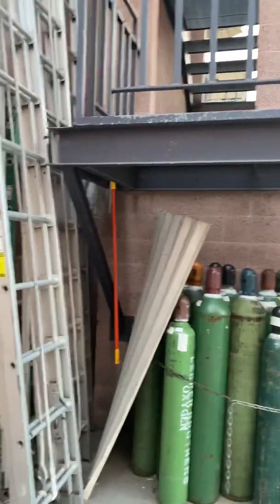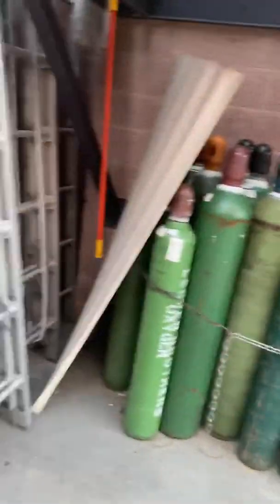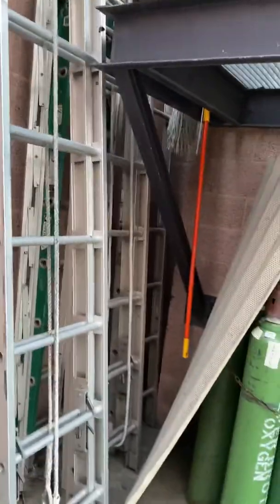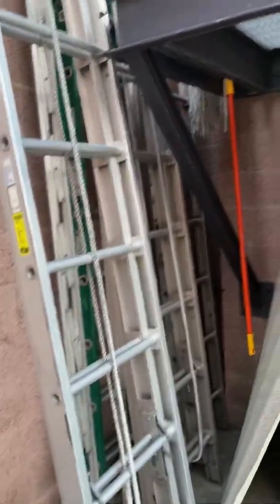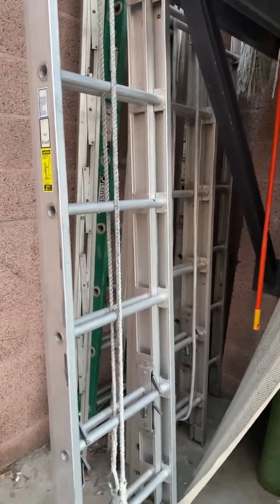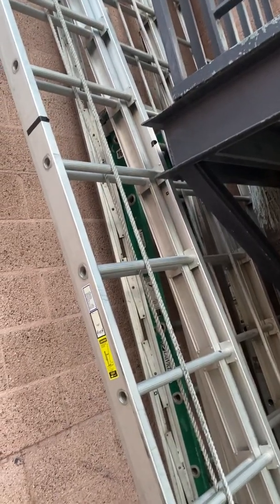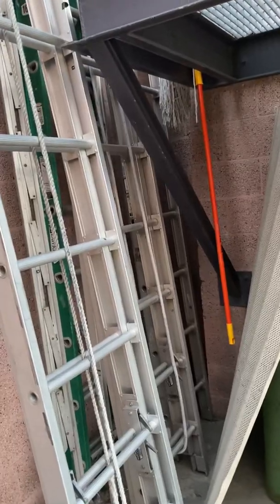Each portion of the ladder has 12 rungs total, each rung being 1 1/4 inches in diameter with a 0.065 internal diameter thickness. Each rung is attached to the beams through a weld and expansion process that provides 95% of the ladder strength, the remaining 5% coming from the rung plates and the 4 rivets.